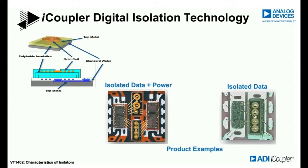You can see there are two kinds of coils. Some ADUM chips do power — in the middle image there are two bigger coils and four smaller coils, which is a chip that does both power and signal transmission. The chips we're talking about don't do power transmission, so you do have to supply power and ground on either side. Although, with our USB isolator sold in the Adafruit shop, we have two chips: one does data and one does power, doing electrical isolation like a mini transformer and DC-DC converter to give you isolated 5V output from 5V input.